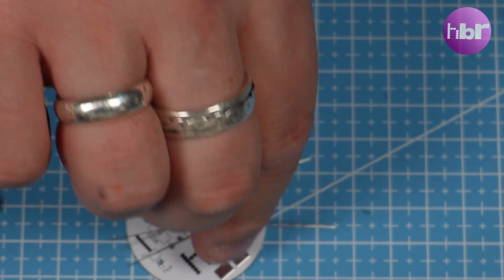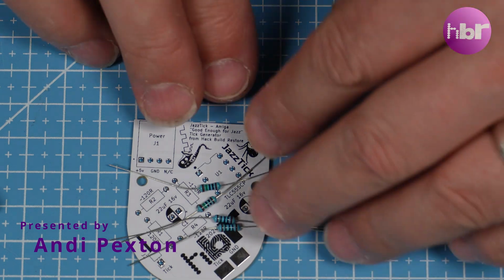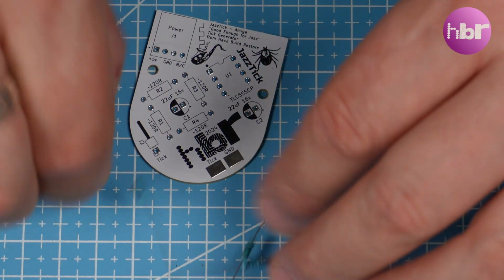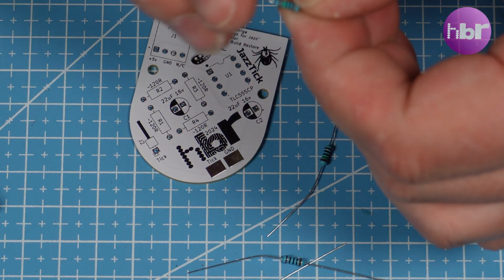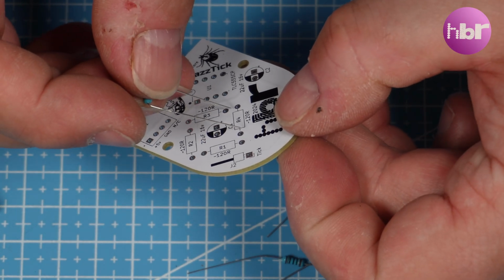Rather than taking a single resistor, it takes 4. This allows you to fettle the resistance a little bit to tune it to the right frequency. I'm looking at using 100 ohm and 150 ohm resistors. The actual value we require could be anywhere between 350 and 550 ohms.